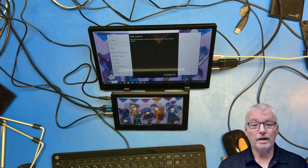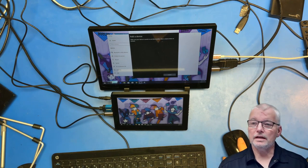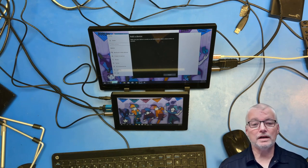I do have some more displays to look at of various kinds, and I do have an upgrade video very similar to the first one I did on reusing LCD displays from laptops, only this time I'm going to be, first of all, getting a larger format screen, which was a 1600 by 900, which I didn't have a driver board for before. We're going to give that a go. It required a four-channel cold cathode fluorescent driver. I didn't have one of those. So now I do, so we're going to give that a go.